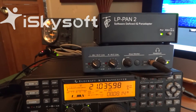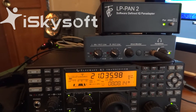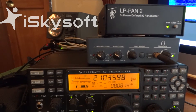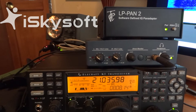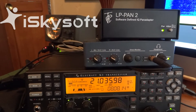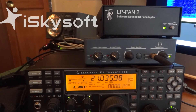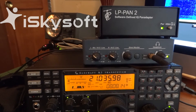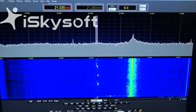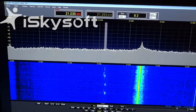I've had a horrendous noise problem for two years now, and even with all of the best radios out there, just couldn't eliminate it. Even the K3 had trouble with it. But using the LP-Pan and the EMU-0202 sound card and the NAP-3 SDR receiver off the IF coming out of the K3, I have a pretty nice receiver here. There's our band scope — you can see the CW signal and everything looks fine. We can identify DX stations.